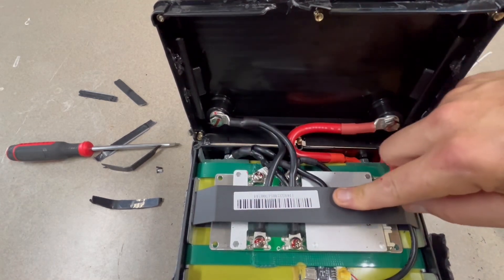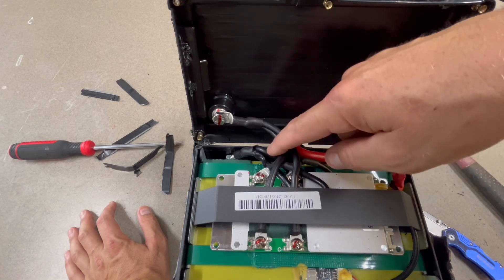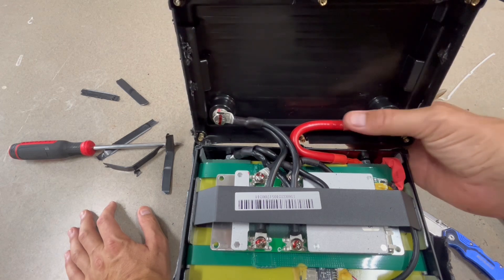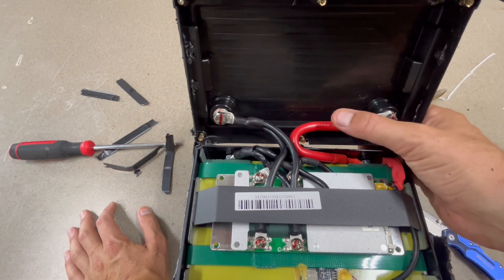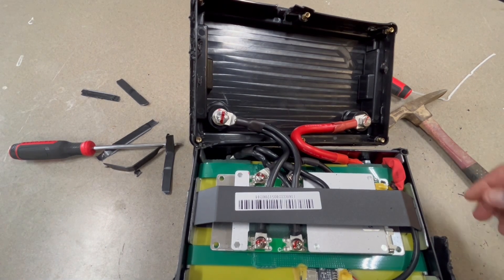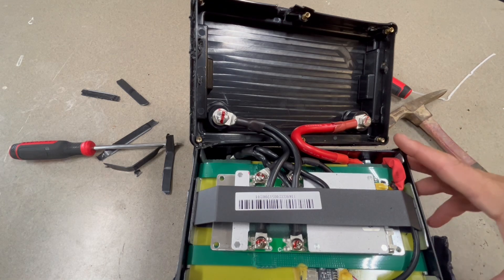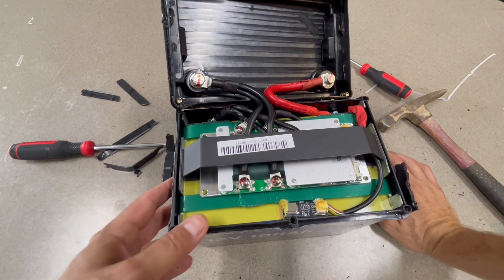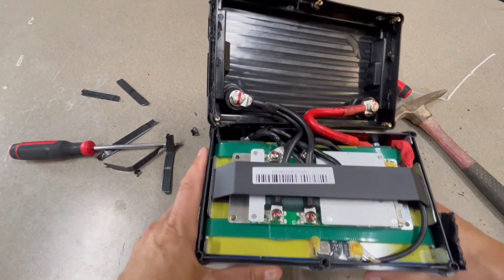The conductor is coming off of the battery cells to the BMS. There are two 8-gauge wires for the negative. For the positive, I can't tell — I don't think there's any behind the heat shrink there, but peeling that back a little bit it looks like either a 5-gauge or a 4-gauge; I think it's a 5-gauge. Just like one of the other battery builds I just looked at, you're going to want to definitely check the manual to see whether the batteries can be laid on their side.